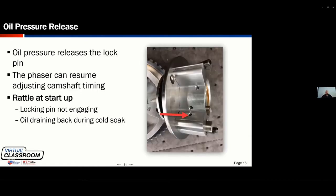And one thing too, Tom, is that's a chronic issue — that pin, whether it locks, engages, doesn't engage. I think for technicians out there, all of us have turned an engine over when doing repairs. And you realize when you're rolling those camshafts over, especially if the chain's disconnected and you're just doing the camshaft with the valve trains in place, how violent it is when you roll over the high points in the camshaft — between when you have tension and not tension — when you're just trying to line some things up.